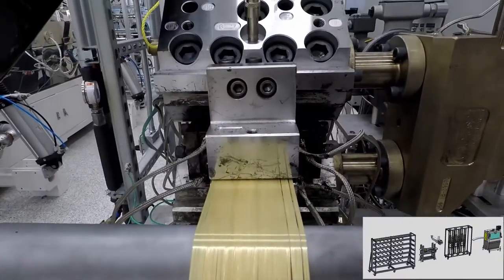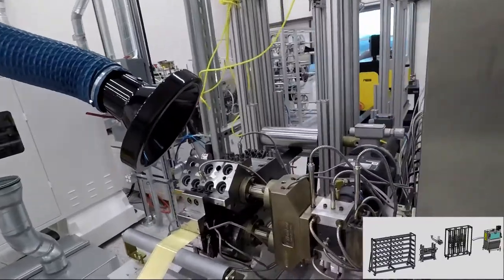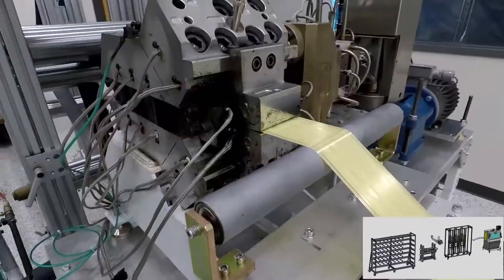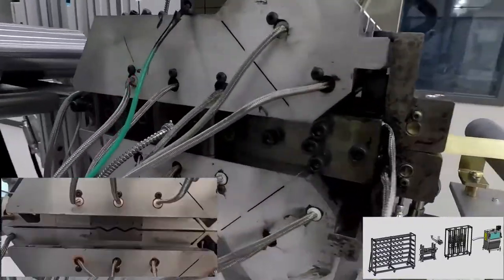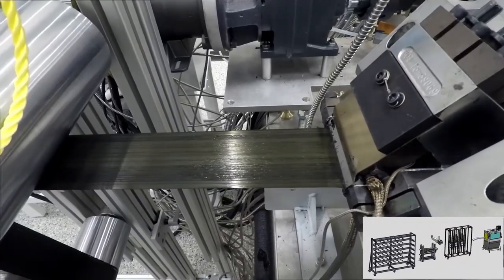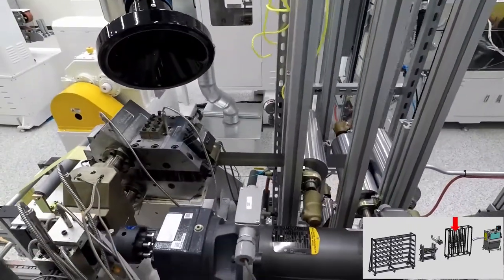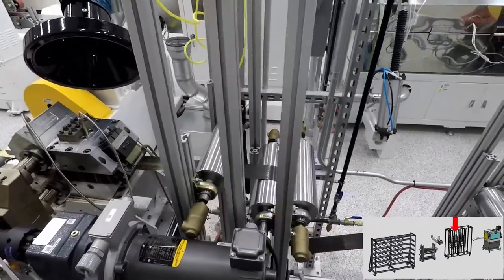This die is fed with molten thermoplastic resin which is metered by a melt pump. The resin is pumped into the fiber bed using the wave plate design. Here you can see the prepreg tape exiting the impregnation die. The tape is sent through a series of consolidation rollers to compact and cool the tape.